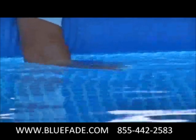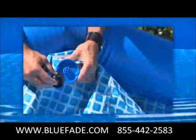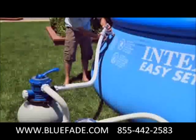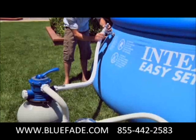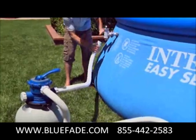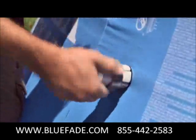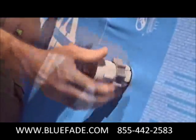If you have water in the pool already, unscrew the strainer cover and insert the black strainer hole plug to prevent water from draining out of the pool. Then disconnect the pump hoses from the pool. Locate the two B adapters and connect them to each of the black connectors on the pool.